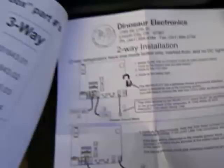At the time I didn't know if the heater was bad or the circuit board was bad, so I bought them both. This is actually an aftermarket circuit board — not the Dometic board. It's called a Dinosaur Board, part number 9950-4, priced at $193. It comes with installation instructions and fits a wide range of fridges. It covers two-way and three-way configurations, and there's a pin-out equivalent for the two-way Dometic board, which is what I have. The instructions seem clear.